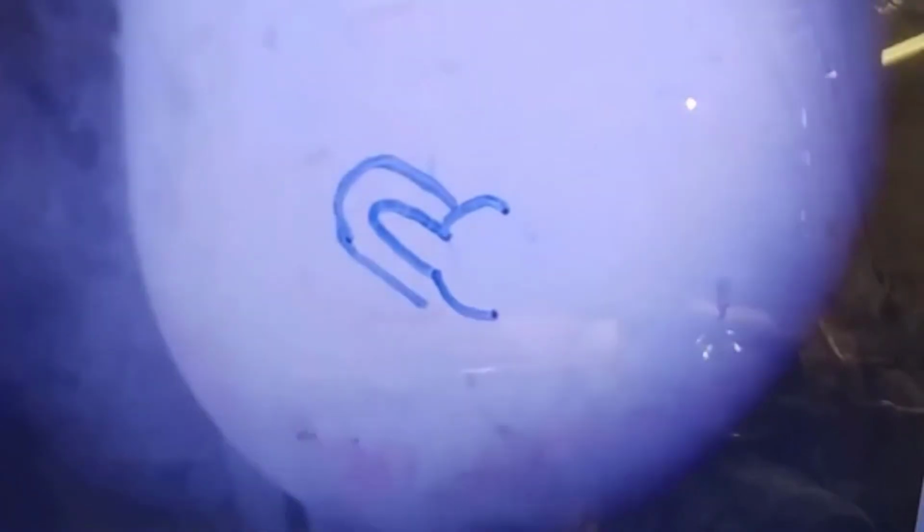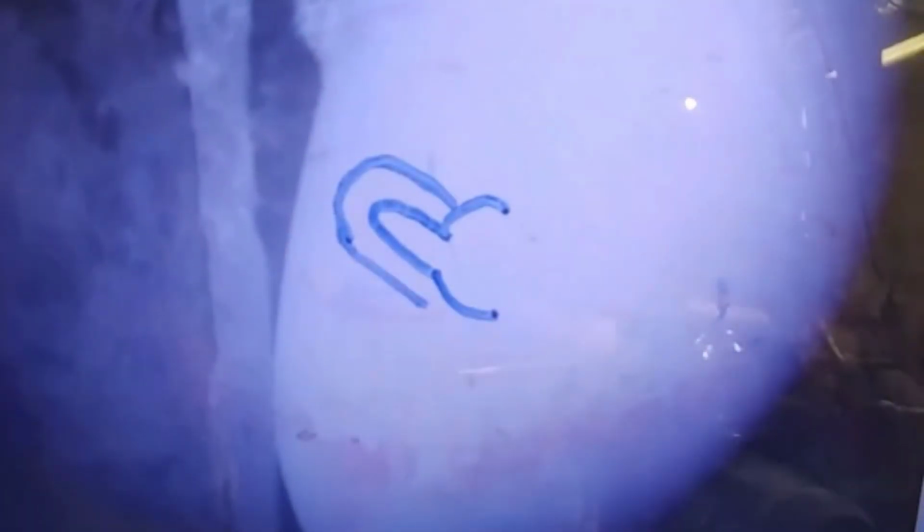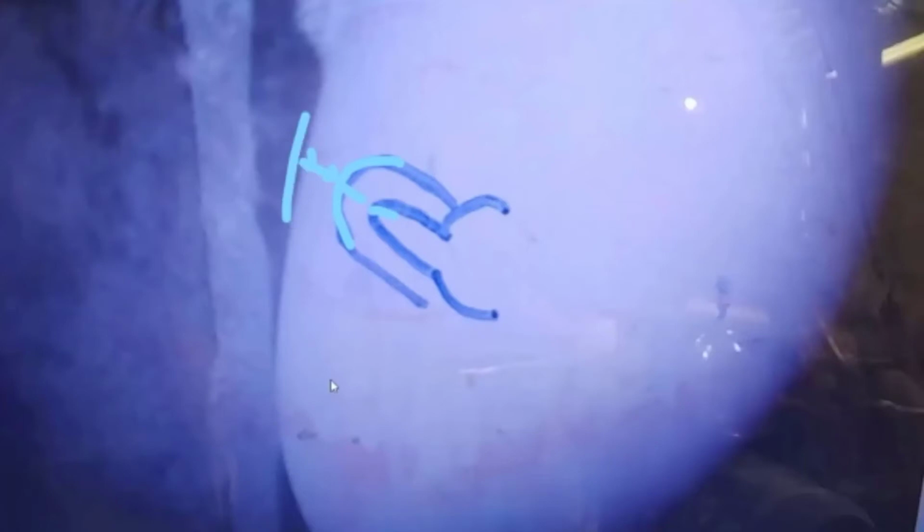Now when I stick the piece inside the hollow form, you see that now when I bang it into the wall, you can see here that cutter's here. My intended wall thickness is here, 3/16 inch. And the wall itself is still here. So this much material needs to be removed until this ink drawn line is on top of the wall, the diameter or the outside diameter of the piece.